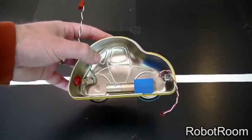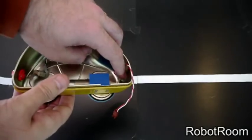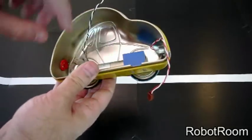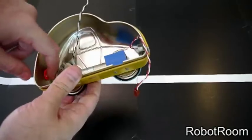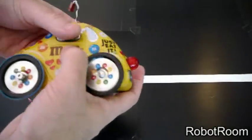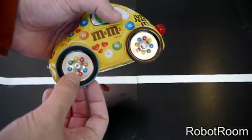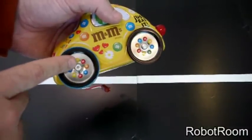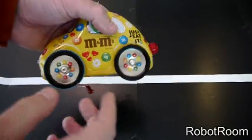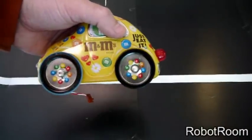This is a side view of the Yummy robot — the side without the PCB in it. It has a front headlight, a motor with a mounting block, and a place for the tail light. One of the wheels has a rubber band for friction; that's the wheel with power going to it. It has a custom-made coupler that connects the wheel to the motor shaft. The rear wheel spins freely, exactly as it was on the original tin.